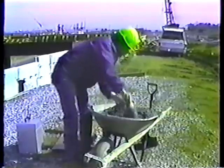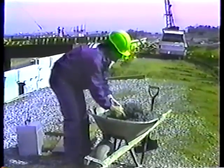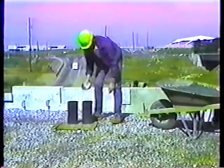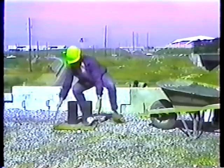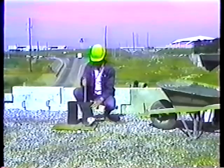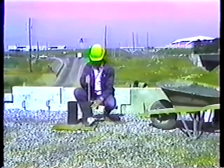Place the first layer into the mold, moving the scoop or trowel around the lip of the mold. If the concrete isn't distributed evenly inside the mold, use the tamping rod to move it around. Rod it 25 times, spiraling toward the center. Full depth for the first layer.